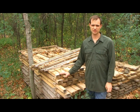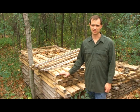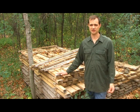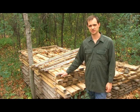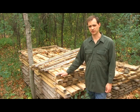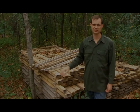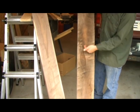Oh. You also typically will end up with a smoother finish on the material when you're done. Like in this case, these boards here, they're definitely not a finished board. They're not planed, but if you were to compare this to a circle mill blade, it's much smoother. There'll be a lot rougher finish. In fact, you'll see the curves of where the blade actually went into the log. Here is going to be the board as it comes off the mill.